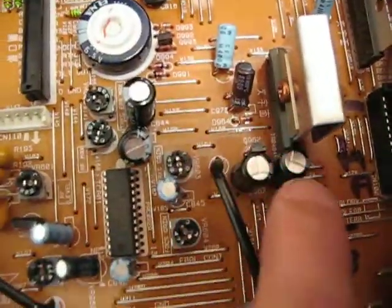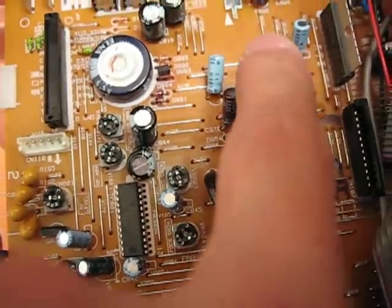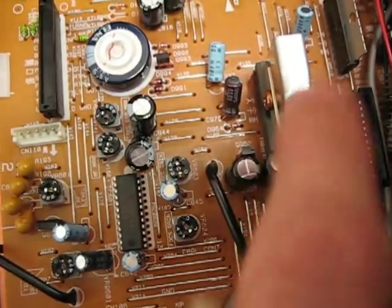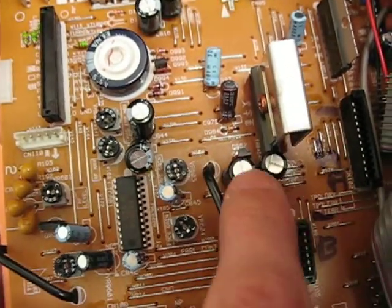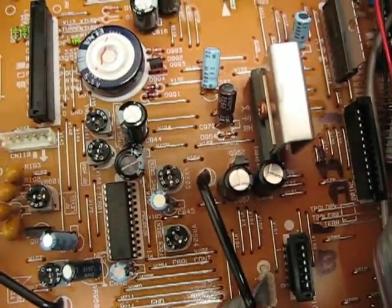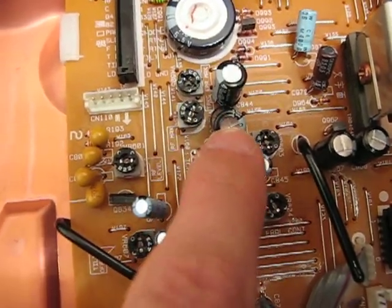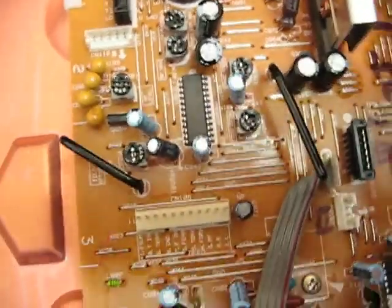Over here, also 10 times bigger. These are for the focus and tracking motors on the optical assembly. This is a very noisy part, and they had already put pretty large caps here, but we put much larger caps there, which of course makes quite a difference. These all have to do with the RF stages, so we want all that nice and clean as well.